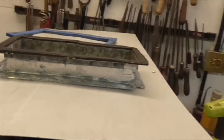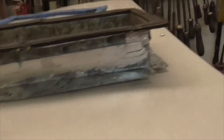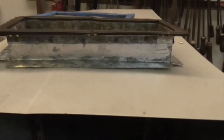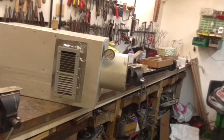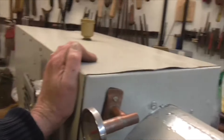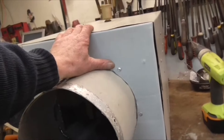Moving on to putting this piece in the side here. I think we could put that halfway down somewhere like that — let's measure it up and get it in position. Had a bit of a clean up, got all the dirty marks off the tin. I'm going to close this with pop rivets because the self-tappers are proving difficult — this is very thin metal.